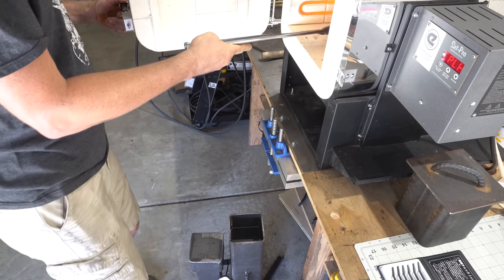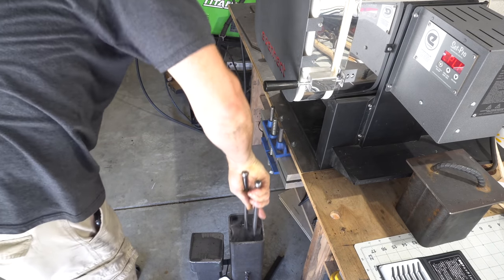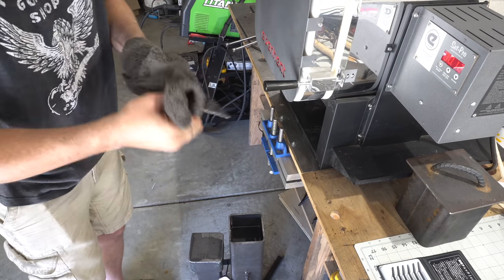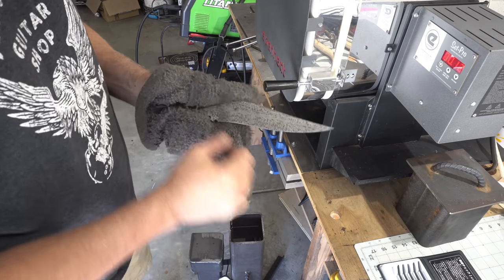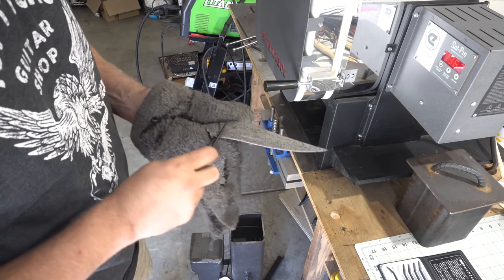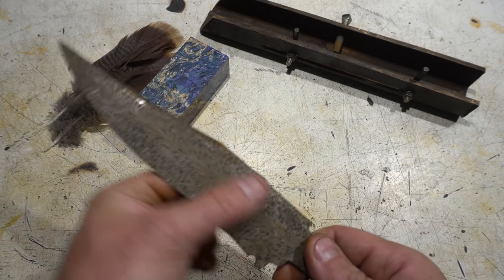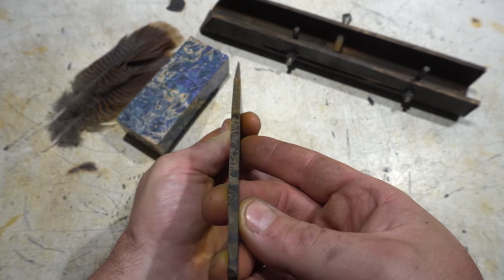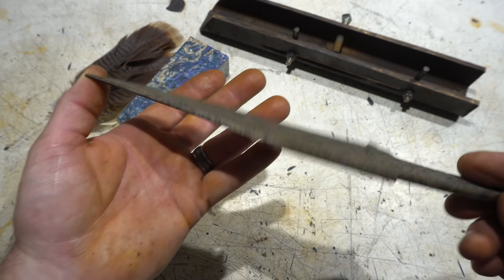After three normalization cycles, I'm ready for the quench. This is 1095 so it gets Park's 50 quench oil. You probably can't see it but this is a 60 HRC file, and this one is a 65 HRC file. Well, there we have it folks — it works after the heat treat and the temper. There was a little warp in it but I took it out with the three point jig and the temper. She's nice and straight, and you can see a bit of the pattern. Very cool — it should look pretty nice.